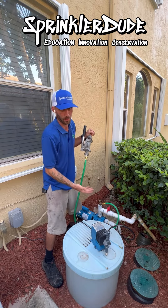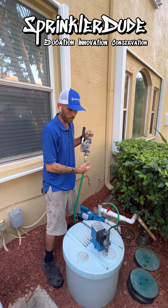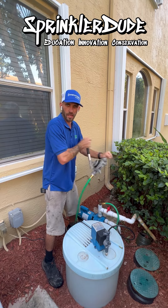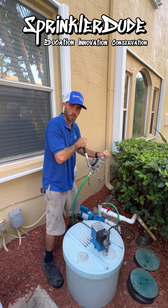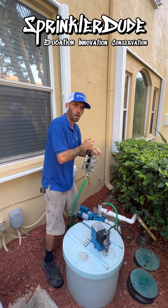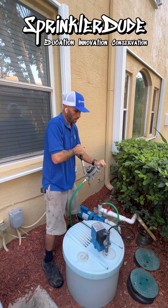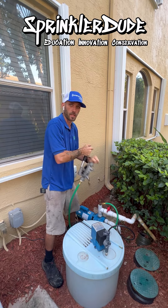So I'm pulling — actually pulling air, but also the water with it. And I'm trying to evacuate all of the air from this line. While I'm doing that, it's pulling the water up to the check valve. And if the check valve hasn't failed, the water will make it past the check valve and stay there.